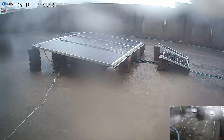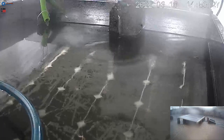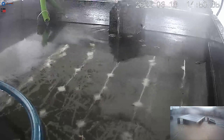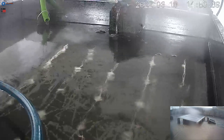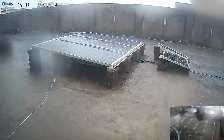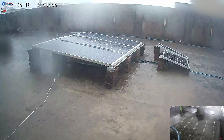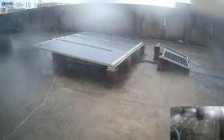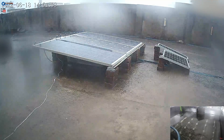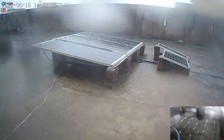Now I will show a practical demonstration of rainwater harvesting. We need water to achieve the active water cooling process, but we cannot use any type of water — we only need rainwater. The reason is that rainwater has no salt and minerals. If we use water containing salt and minerals it forms a white layer on the solar panels which totally blocks sunlight from reaching the solar cells, and it is very difficult to remove that white layer. This system automatically collects rainwater whenever rain happens. Rain falls on the surface of the solar panels, is collected by the half PVC pipe, then filtered before being collected in the bucket for later use.